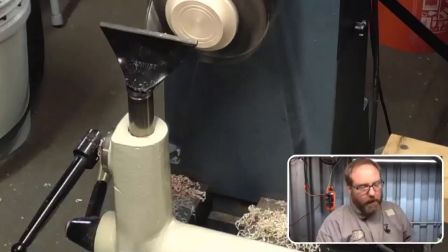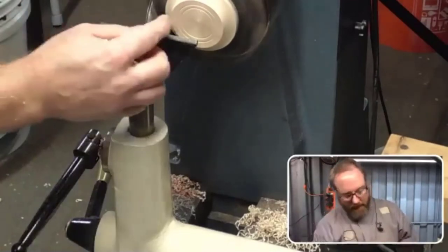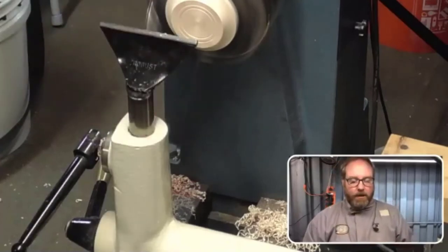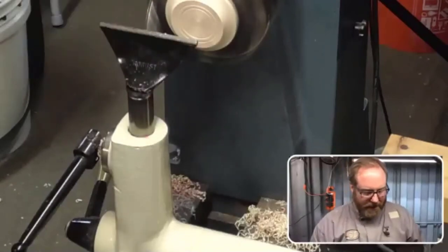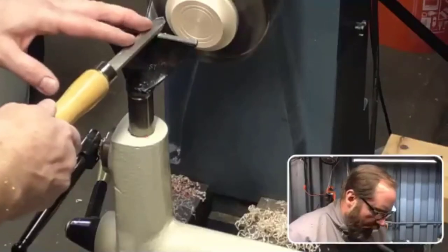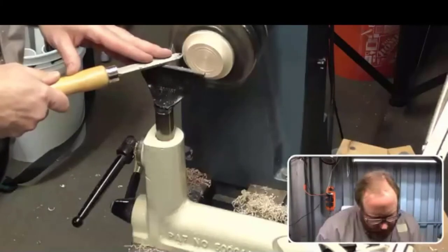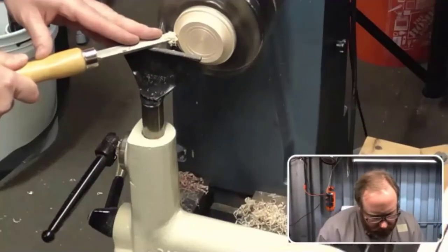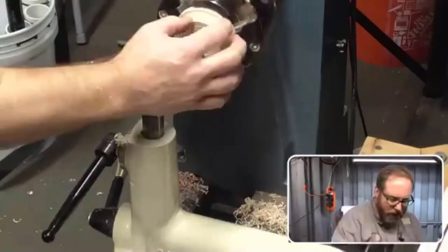And this is really for all the wood turners. You guys are going to pick the piece up and recognize, okay, he actually turned the bottom of that. He didn't sand it flat or any of those cheating things. And then I'm going to use the same tool, and I'm going to come up here this way, and I'm going to create a little lip, a little 90-degree step, and that finishes off that OG shape.